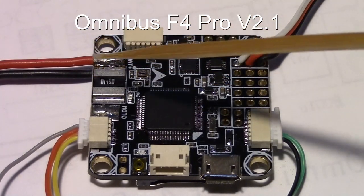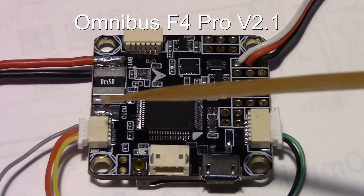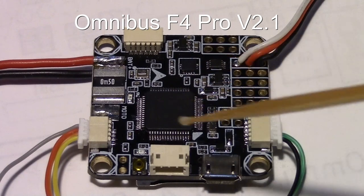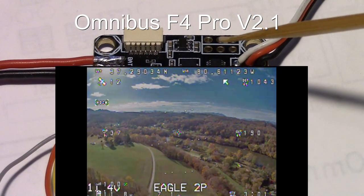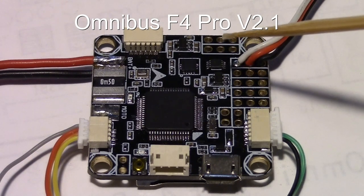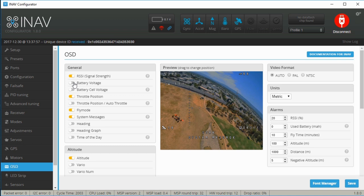The main battery can be connected on this side of the resistor, and then you can connect another wire here that goes to your ESCs or other loads. The voltage and current can then be displayed through the built-in OSD chipset on the bottom of the board, and inserted into your video feed going to your goggles or ground station monitor. The OSD itself can now be configured right within CleanFlight, so you don't need a separate OSD configuration tool like MW OSD.